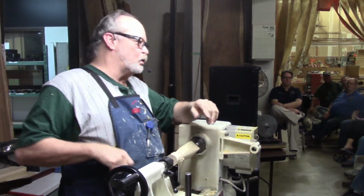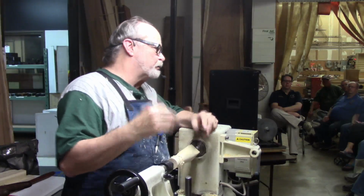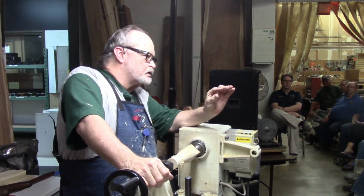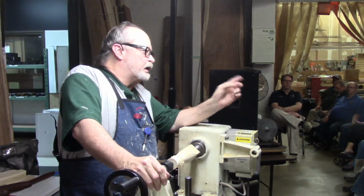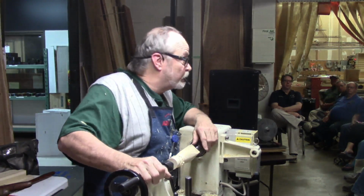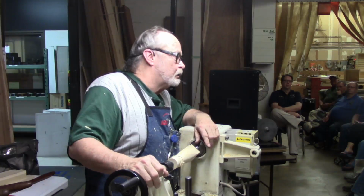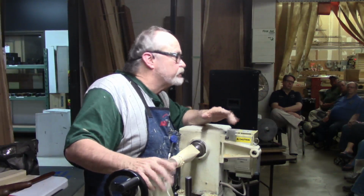Now, you did ask a good question, but there really is only one answer. It's whenever I'm no longer producing either a good surface or the shavings are getting smaller and smaller, and that tells me that it's dulling. The better the steel, the longer the burr. If you have an old carbon steel scraper, it hardly will hold the burr more than a minute or so in many woods. If I've got an M2 high-speed steel, it's going to last longer.